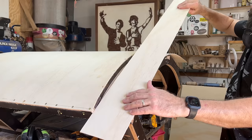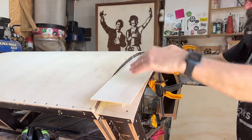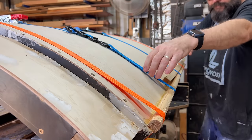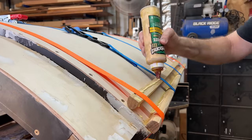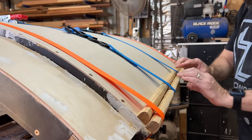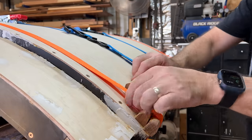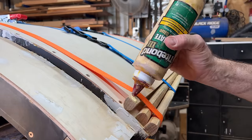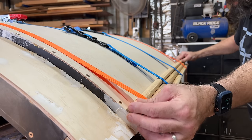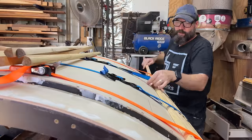I also did a double layer of 3mm ply on the kickboard, just in case, you know, it gets kicked. Time for the part that I've probably lost the most sleep over thinking about the process. This entire front face is going to be covered in the pine pallet half square, half round dowels. Initially, I'll just do a few pieces at a time until I establish a good routine and ensure that it all gets clamped down sufficiently. I ended up doing about 10 pieces at a time and I would come back as the glue had set on each round until I made my way right over the Palletwood Sydney Harbour Bridge.